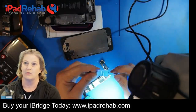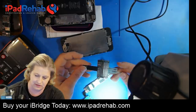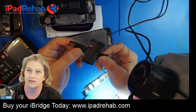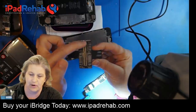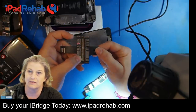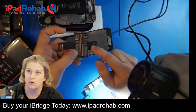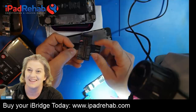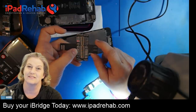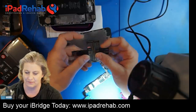All right, so this is what one of the flexes looks like for the iPhone 6 set. Since this is an iPhone 6, we're going to give it a try. You can see what this thing does. It connects into the phone's connector, and then it has this breakout of all of the lines for both the LCD connector and the touch connector. Then you can plug in a screen over here so that you can see and measure live voltages with the screen connected. As we're going to see in this stream, you have to have the screen connected in order to tell the device to generate some of these voltages, because otherwise it doesn't work. So having that screen connected, this thing is a real time saver.